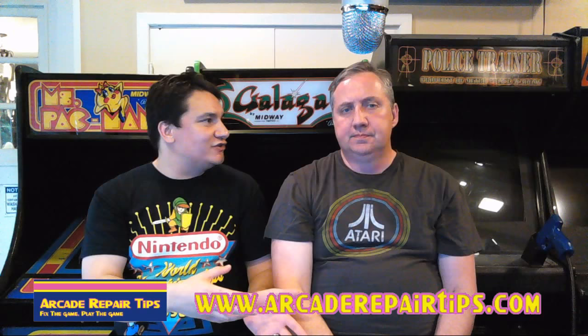And that's a thing here, Tim. Like somebody said, I just replace a micro switch if I think it's bad. Well, you can do that, but the whole idea of this is to narrow down. Is it a wiring issue? Is it a switch issue? Is it a board issue? Is the switch making the right connection to the board? Is the board interpreting that signal properly? So like Tim mentioned, the first thing you want to check a lot of times is the switch, instead of the wiring or the board. That's why you want to test that. If it's working, then you move on to wiring. It doesn't take but a second to go ahead and test that.